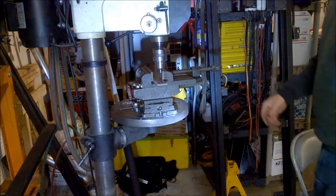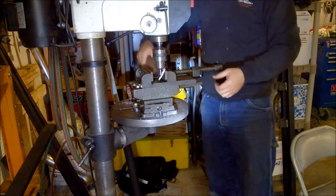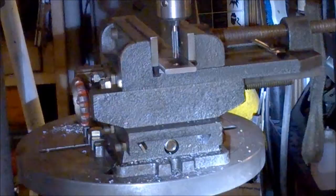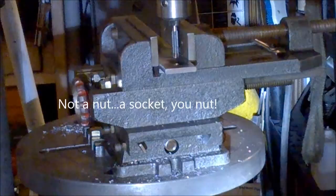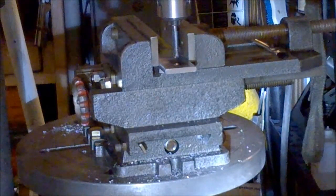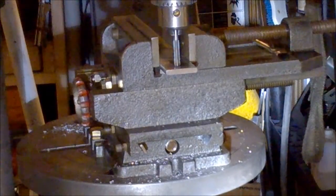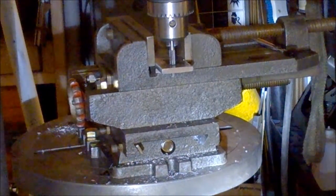I'll come in on each one of these parts and get a little countersink. Now let's put some threads in here. I don't have a spring center yet, and I'm not well-equipped on tapping implements — I've just purchased things as I needed and never bought kits. So what I do is take a nut, go to the top of the spindle, bring the quill down by hand, and just take a half-inch ratchet and go for it. Once I get started I might power it up, but maybe not this time because my speed is set kind of high. Then I'll do the other three off camera.